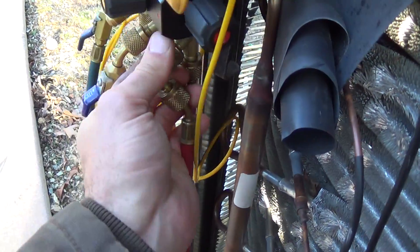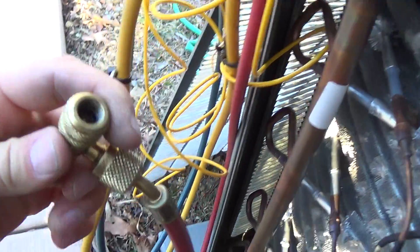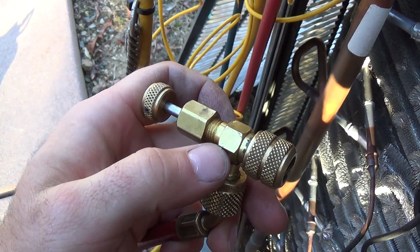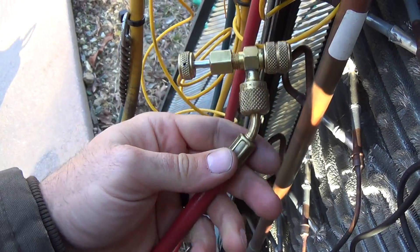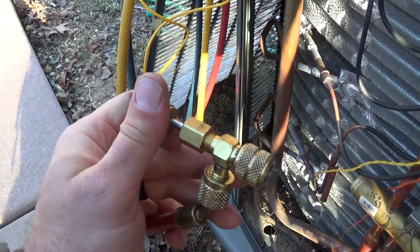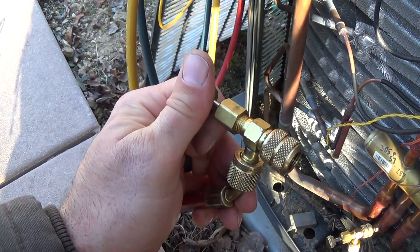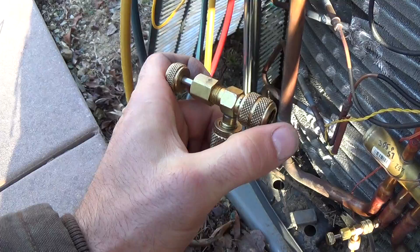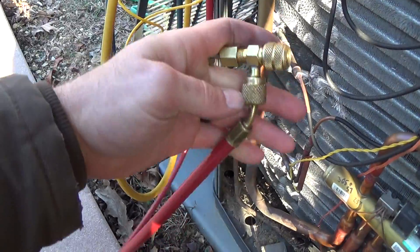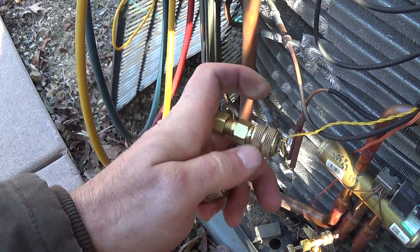I got it tight so it doesn't loosen up in my van. This one has a back seat, so when you screw this all the way out it will actually trap refrigerant in here, so you can go from one unit to another without bleeding your hoses again. Keep in mind that if you're not going to hook straight on to another unit, you'd want to leave it cracked a little bit so it's not back-seated, so you're getting all the pressure when you run it through the low side. You suck all that liquid out of the liquid hose, reducing all the pressure from the Schrader core all the way through and out, making it super easy to unscrew.